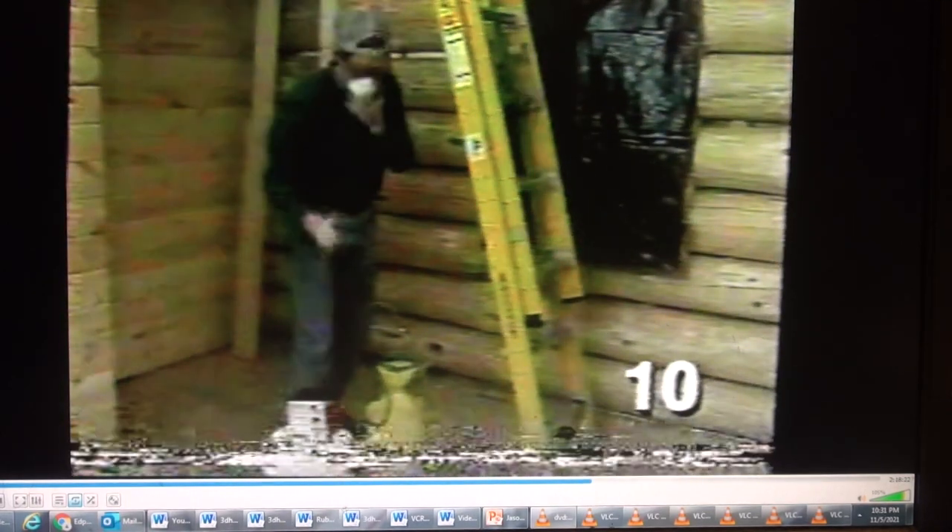We've also covered up the window here to protect it. If you don't want to spend hours shampooing your hair, it's a good idea to cover up your head. We start working from the top and come right on down, using a low-pressure garden sprayer to coat the logs. The exterior was stained with the same light natural shade last fall, but this is a different formula — the exterior stain has a fungicide and a mildewcide, which makes it unsuitable for use inside. The exterior formula also has ultraviolet inhibitors, which the interior product does not. If your interior logs get a lot of direct sun, you can specify that the UV inhibitors be added to your stain.